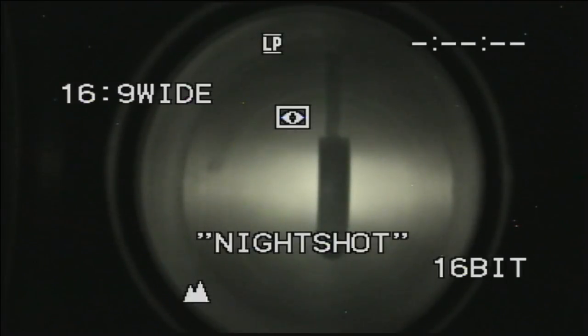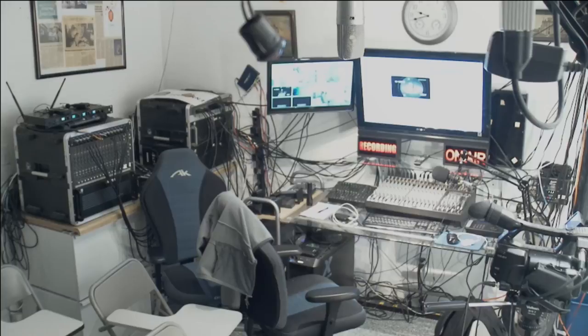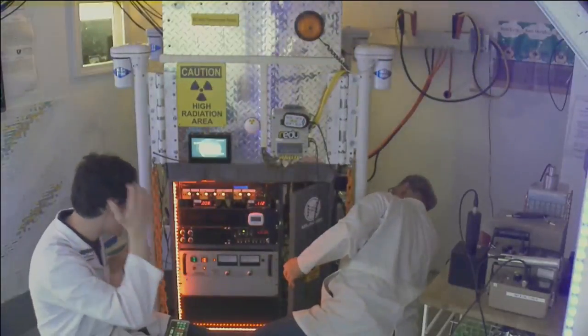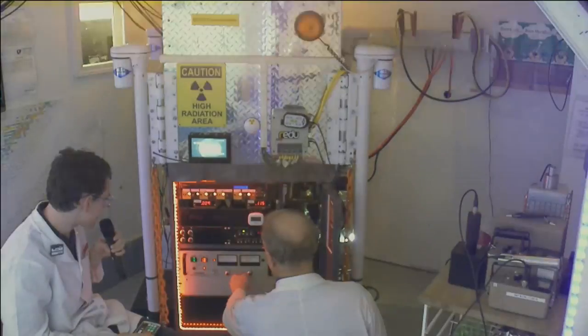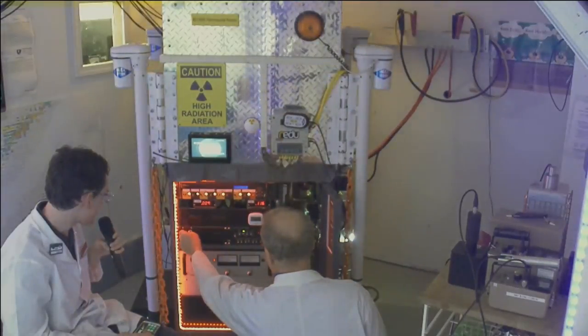What? We're out of D2? That's already opened up. We're really low on that dial. We got a bottle of deuterium sitting out to the side there, so just getting that. It's really low in pressure. You can barely read how much is registering on the scale right now, so you're just getting enough flow to the machine. But now that we've got that sorted, we should be able to start dropping flow and increasing voltage. Feeling better now? Yeah, we're feeling better. Sweet.